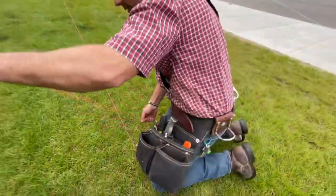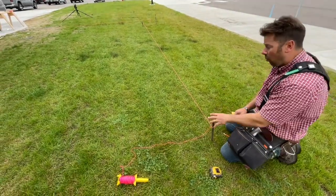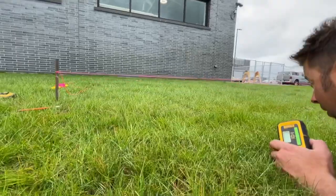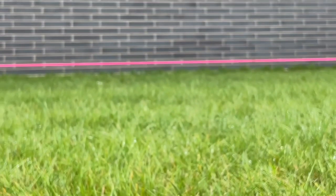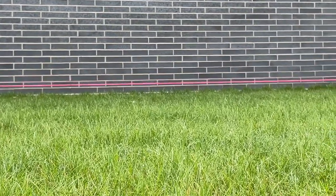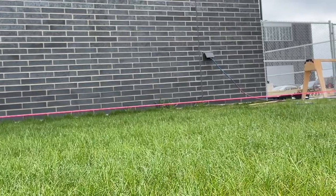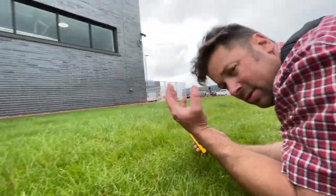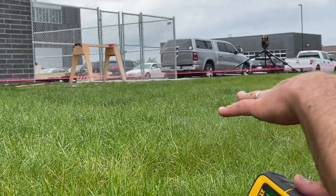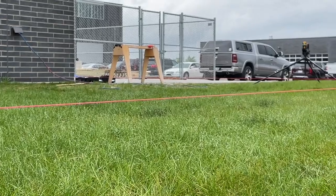The next group runs over — they can start two feet in using a lark's head, and we'll basically make a zigzag pattern here. One other way to determine if I'm level: get down at level with the building. If you look at the building with the level line, you should be able to look across that first course of block or brick and the string line should be absolutely perfect with it. Also notice that the distance between the ground and the string line should become less and less as you move towards the building — another way to verify you are setting the correct height. Those two lines, if lined up — the foreground and background — form a co-planar flat surface you could set other pin heights to. Usually you just use the laser for this and pound pins to certain heights.